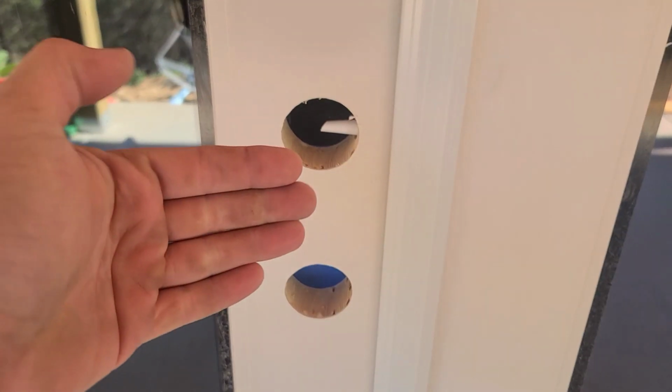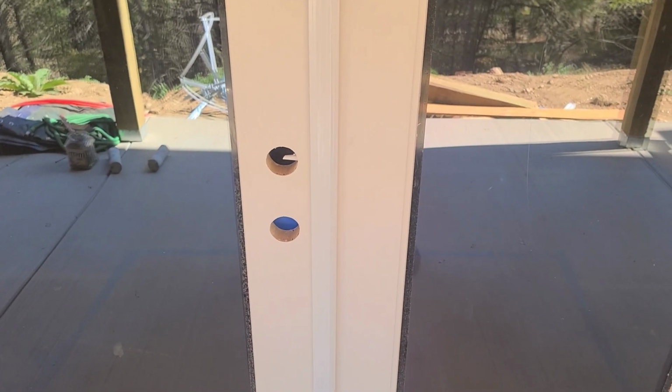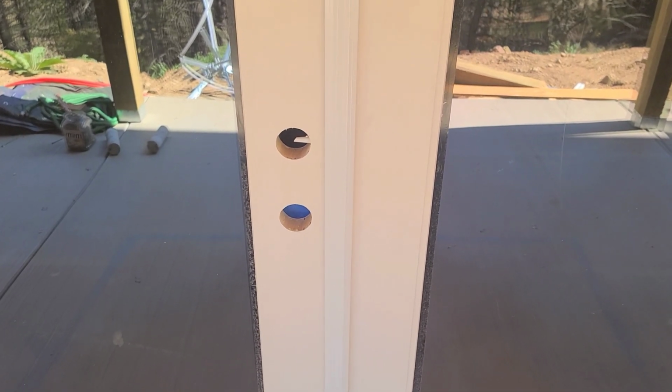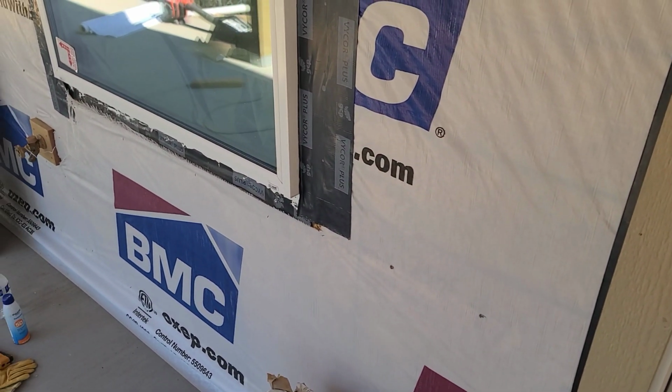So pretty cool. Okay, so they're injecting the sealant now, and the house is getting up. It's pretty cool up on the screen. I'll take you back up there and show you. It says it's at 698 CFM total leakage, and you can see it come down. I also want to show you, and I think they do this on most of them, they put a little screen in here, so that'll eventually all be filled up with caulk. So we'll have a way to show you how it seals up. But I wanted to tell you that we're getting things sealed, and it's still blowing me away.